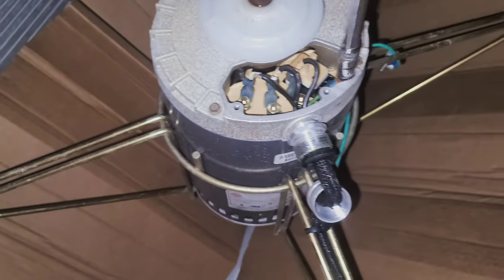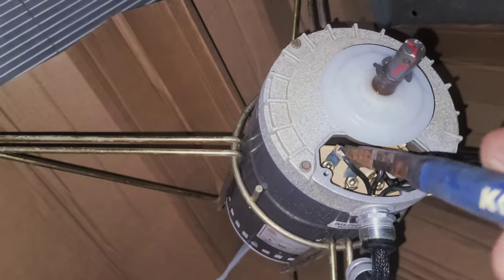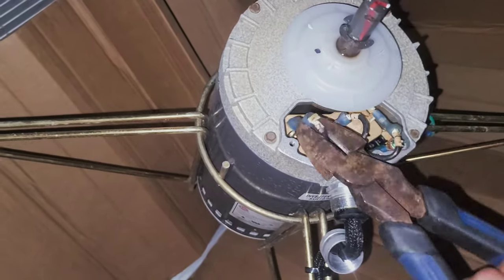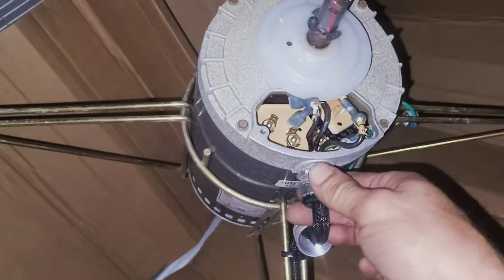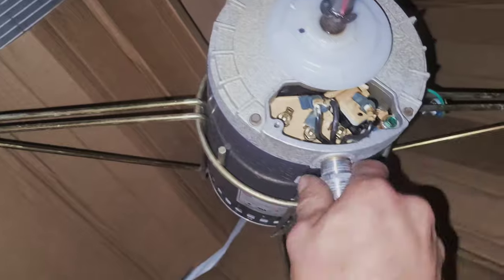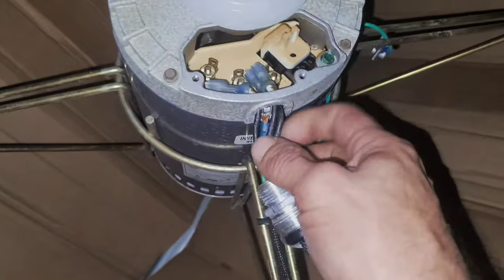I start by disconnecting ground first. Using needle nose or pliers helps to remove the leads. They should be on there tight enough to make it hard to pull with your fingers. Next step is to loosen the female Sealtight nut from the Sealtight connector and pull the black rubber seal out. Now you can loosen the Sealtight fitting and the wire should stay stationary as the fitting rotates around it. You'll need to straighten the leads out and pull them through individually to allow them out.